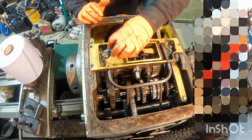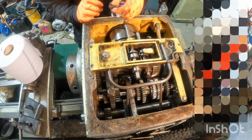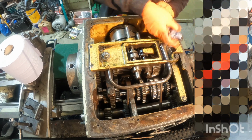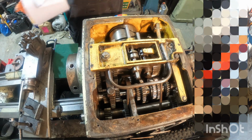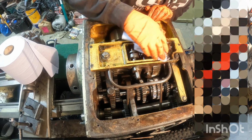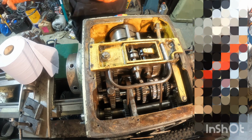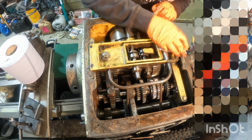because all the machines I've got, the ways are worn, you can feel them. They've been heavily used in one position, and as you get to the ends of the travel, they nip up quite tight. So obviously when I rebuilt the mill I wasn't really confident enough to start attacking the ways, but now I've got a bit more experience and I'm trying to get my head around the theory a bit more. I think I'm confident to start attempting to scrape them. I'm just waiting on a cast camelback straight edge coming in from Lamco Machinery here in the UK. When it does, I'll be making a start on checking all the surfaces of my machines and working through them, scraping them back in, being parallel and square and flat, how they need to be.